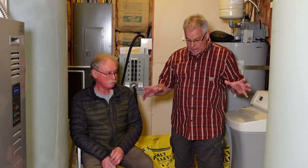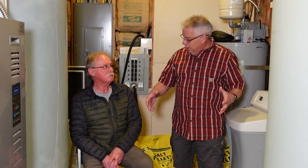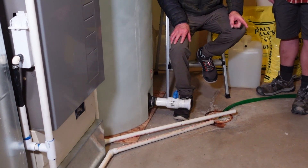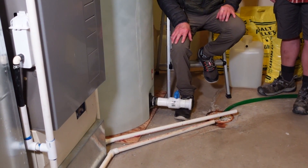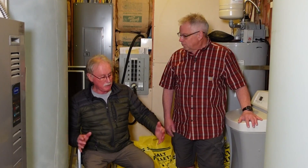Let's talk through a little bit about how this works. You have two tanks and you don't keep them connected all the time for safety reasons — is that right? Correct. Because there are two tanks, and if there was an earthquake, these tanks could move. One tank may move more than the other. And if they're connected together, they're certainly going to snap the plumbing. So when we're not in use, you disconnect the plumbing. And when you're going to use it — like once a month — I'll come down here and connect the plumbing and then we'll use it.